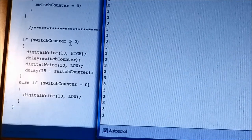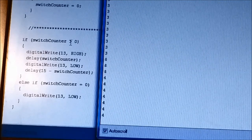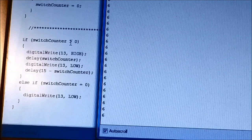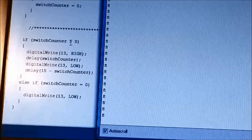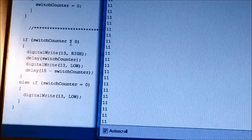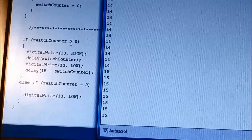Now on screen, we can show you what's happening in the software as we control the Arduino and the motor. As you can see here, this number that you see, we are actually reading the serial output of the Arduino, and it reads the actual speed. Anytime we press that little button, it changes the speed and it changes the value of the PWM signal.